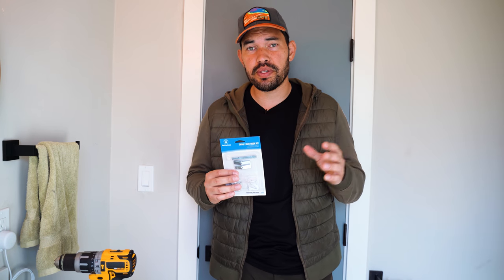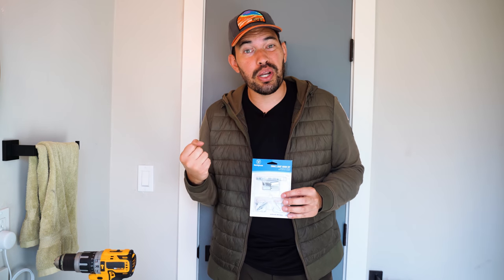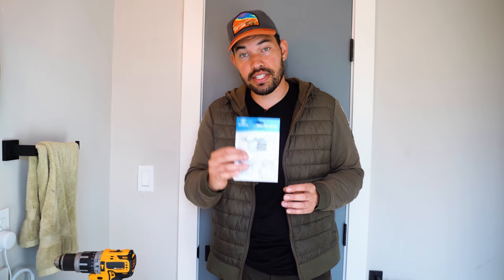The first thing I want to do is put up these hanging pots in the shower itself. When putting in our hooks, you need to get the right hook. I have this one called a Swaglite hook kit. Since this house was built in the 1920s the walls are plastered, so I need something more specific. This has a threaded rod with spring-loaded wings — when you drill a hole in the ceiling and thread the rod through, the springs flip out and catch. It's really good for going into a ceiling, very cheap, about five or six bucks for two. Great way to reinforce. Let's get these up into the ceiling.